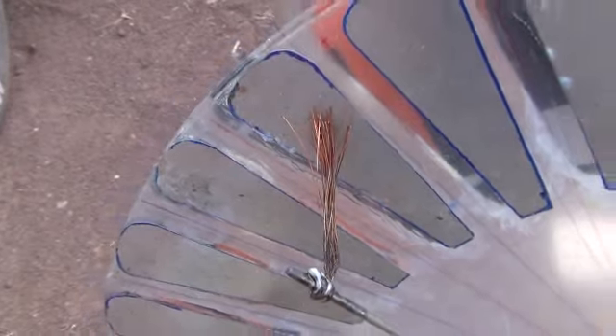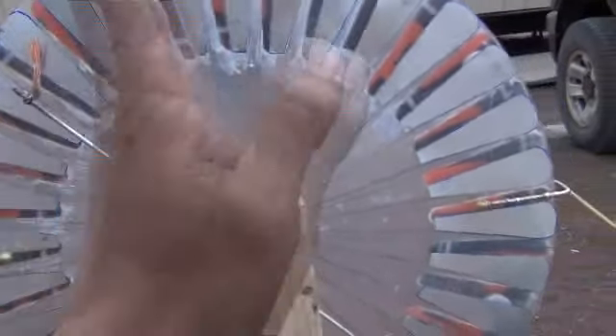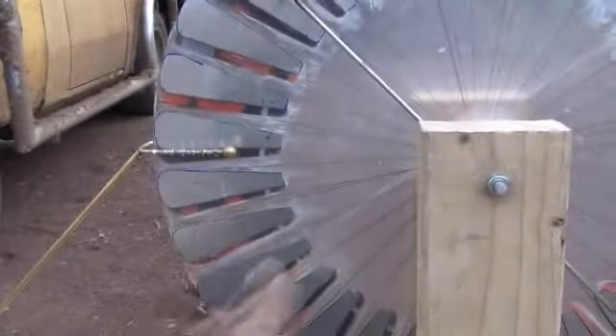That's going to pick up all the static electric charge created by our brushes. There's our brush tip sitting there rubbing against one of the aluminum plates here. If you follow the set of lines all the way through and across, the other brush is touching dead in line — so it's actually in circuit with this aluminum plate over here. That's actually scrubbing off positive and negative electrons, making sure they don't pass by each other, so there's more negative on one side and more positive on the other.